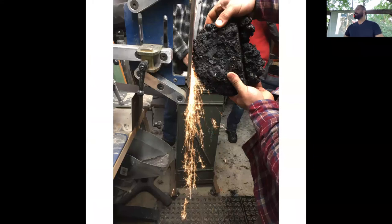3,400 degrees, probably around there. It feels like every bit of that when you open it up. Actually the temperature is really the operative thing. You have iron oxide, which is iron ore. And as it's dropping through this furnace, the carbon monoxide from the charcoal fire is stripping away the extra oxides in the iron oxide, and it turns it into just straight up iron. What you're doing is this weird chemical change where you're reducing this material into iron.